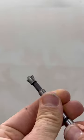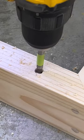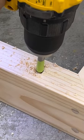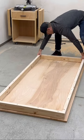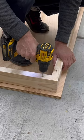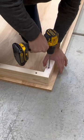When securing a tabletop to its frame like in this workbench, I do not use regular construction screws because I find a different screw works better. I always use pocket hole screws because of the way the head is designed — it pulls the tabletop to the frame for a tight connection.